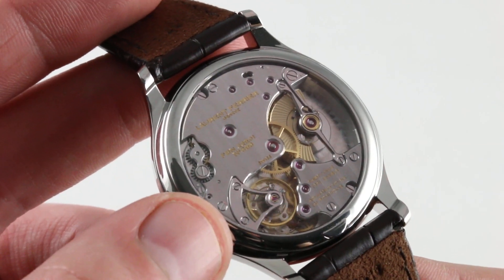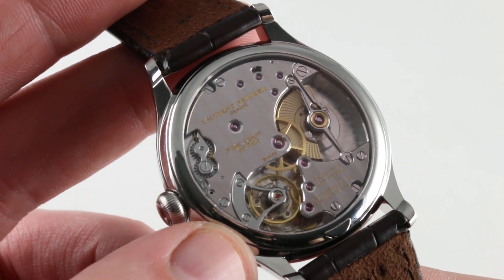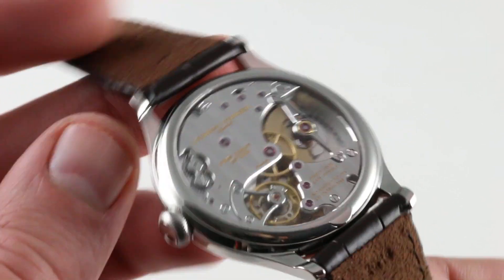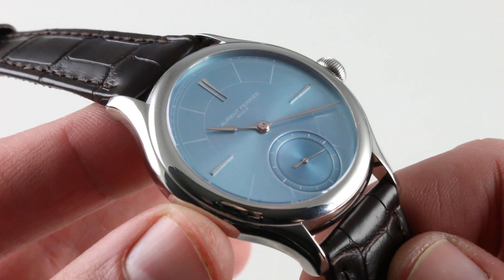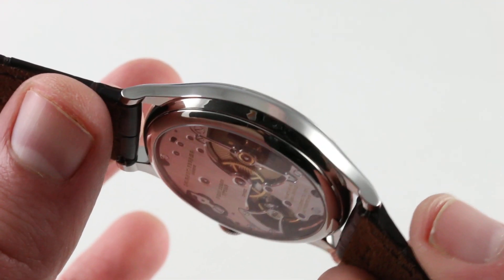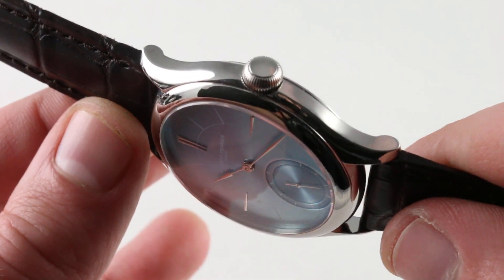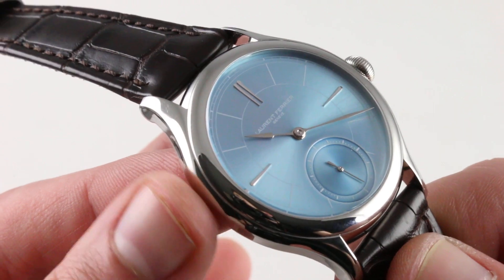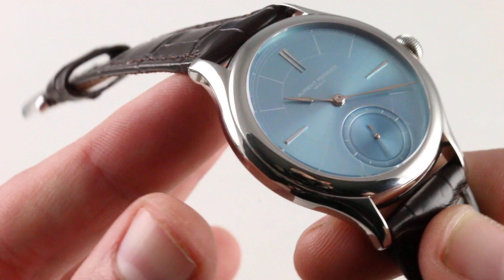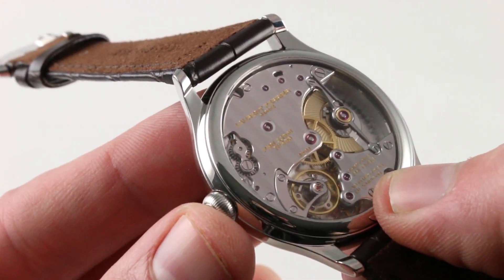It's effectively the natural escapement originally envisioned by historic watchmakers such as Breguet, adapted for a wristwatch application. It features a slight over-coil profile to help the watch meet outstanding chronometric precision tolerances in six positions — that is, precision timing without respect to gravity. In any position, thanks to the over-coil architecture, the watch will keep excellent and consistent time, with a small delta between each position.